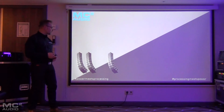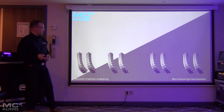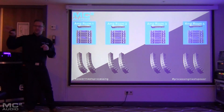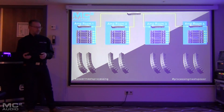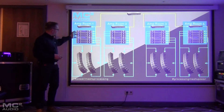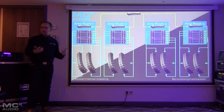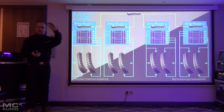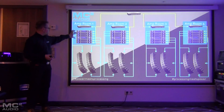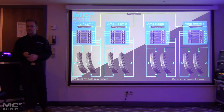Taking the scale up a couple of notches, this is an example of a potential stadium system using some line array speakers. We've got different amplifier rooms or control rooms around the arena, all connected by Dante. The number of DSP amps used in each amp rack is purely dependent on how much control we want over the line array. If all we want is a four-way system, we could use one DSP amp and a lot of slave amplifiers. But in this example, each line array can be broken down into four zones within the array, giving a lot of control over the processing.